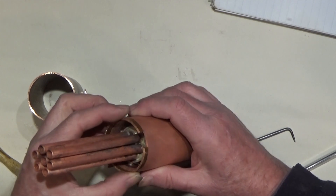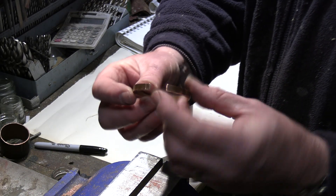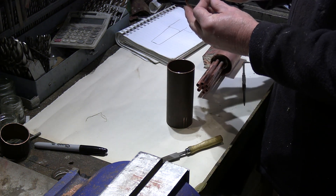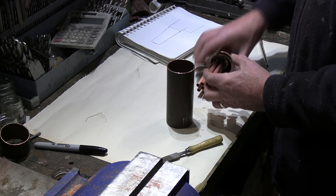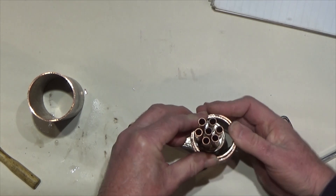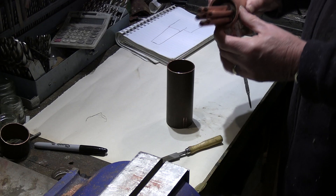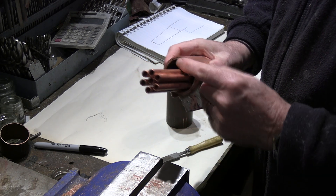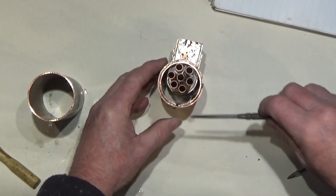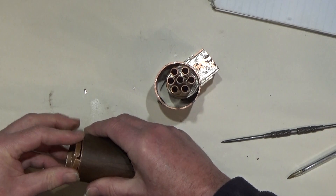What I've done is taken this ring and made these cutouts. It turns out I need to take about three-eighths out of here, so when I squeeze this down it gives me the correct diameter to fit the boiler in — see, that's where the boiler will fit in there. So that gives me one end, and what I need to do now is do the same exercise for the smoke box.